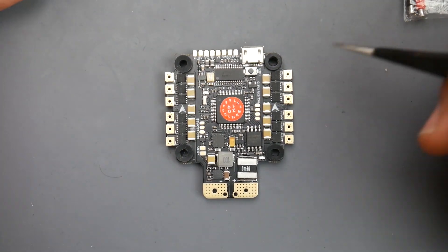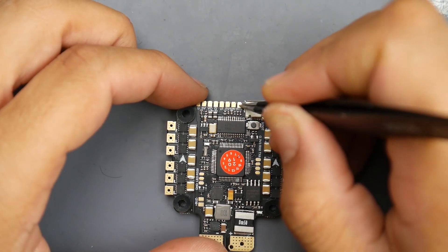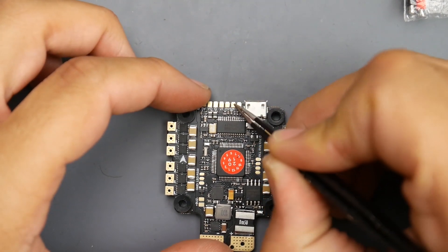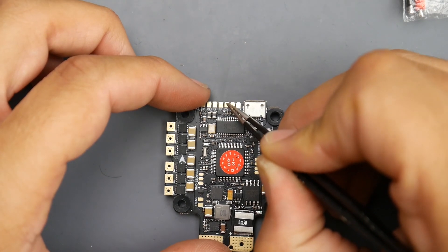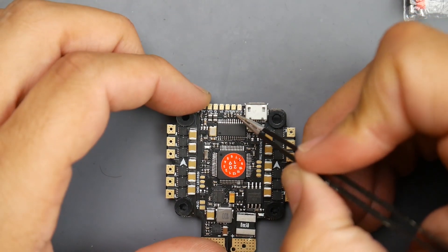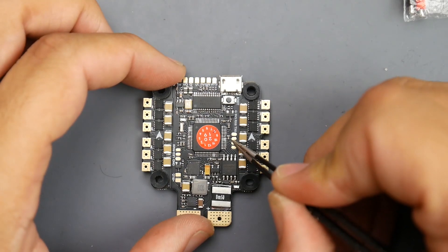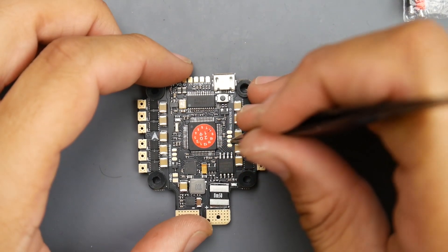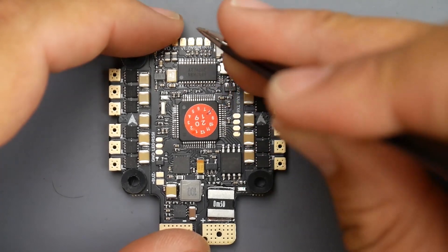The receiver is very important. For SBUS — which is an FrSky receiver — we want to connect it over here. The pad next to the USB is going to be ground for our receiver, which is the black wire. The second pad is going to be our SBUS signal, which is very important — this is where your FrSky SBUS signal connects. The third pad is the 5-volt, which is the red wire. If you're using FlySky iBus, you still put 5-volt and ground in those same spots, leave the middle one empty, and come all the way over to RX6 — the third one down — and put your iBus signal right there.